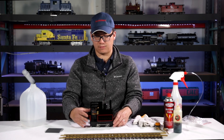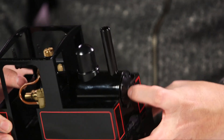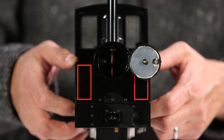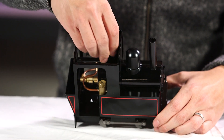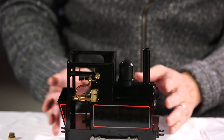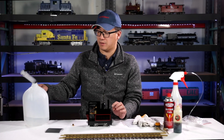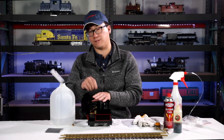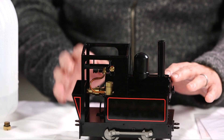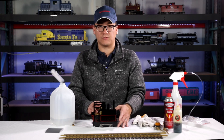Next is the burner here. This goes down into the boiler — it's called a poker burner. This is the water cap; this is where you add water into the boiler. It's not a big boiler, so you don't want to fill it all the way up or there won't be room to generate steam. Usually I'll add it full of water and take some out as a good starting point. You don't want your engine to run out of water because then you're dry firing the boiler and that will damage it. These models are designed to run out of gas before they run out of water.